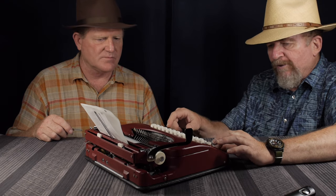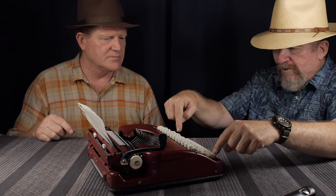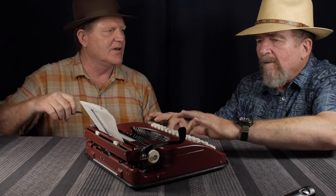It is a carriage shift machine, and the throw on the shift feels shorter than some carriage shifters — you don't have to push the lever down as much, but it's a little heavier because of the different leverage. It has individual stop adjustments for each side of the shifter — both shift buttons don't go down simultaneously; one or the other goes down. That raises the question of shift lock: pressing the right shift button won't release the shift lock on this machine. A lot of typewriters are like that — it has to do with small machine engineering.